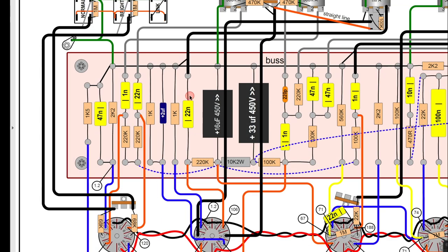I'll show you on the layout exactly what I'm talking about changing. Here is that 1K resistor for V2A — the cathode resistor for V2A. You can see that it grounds on this side, connected to the ground bus wire, and here it connects to pin 3 of V2 which is the cathode of V2A. So I'm going to change this resistor from the stock 1K — I'll try a 2.2K in there and show you how that changes the sound.